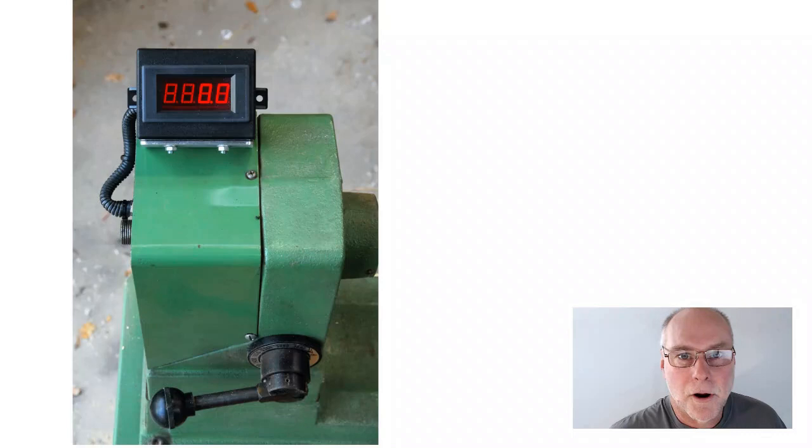Here's the tachometer mounted on my wood lathe. It's very hard to see in this particular shot because I used a long shutter speed, but in fact the display is a lot more visible than it is shown there. As I said, I reckon a blue one works a fraction better than a red one. It reads out constant speed, and by using that handle you can see lower down in the photo, I can adjust the speed mechanically using a belt drive and always see exactly what speed I'm getting.